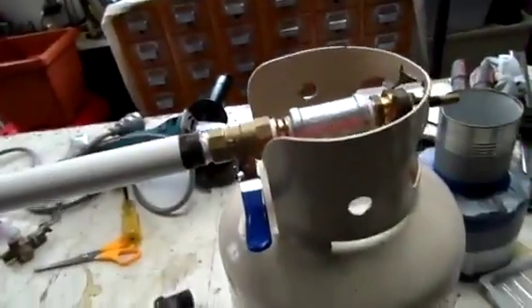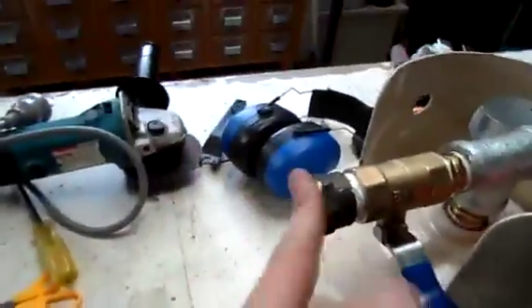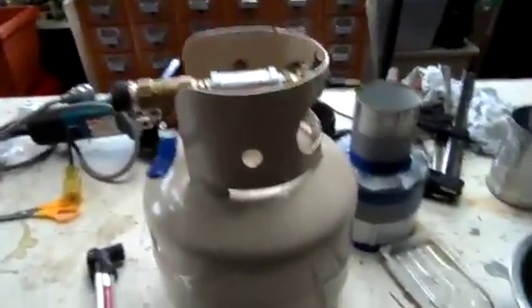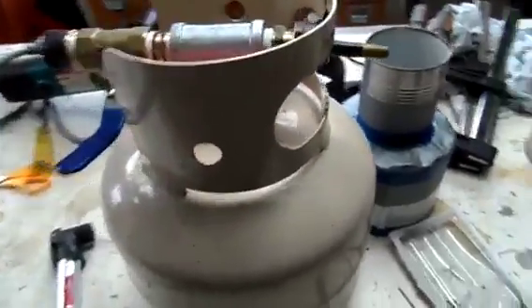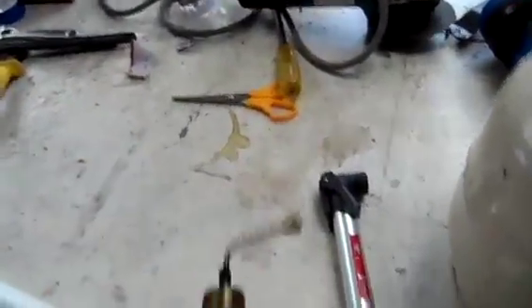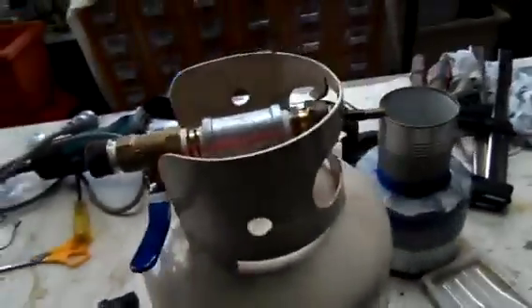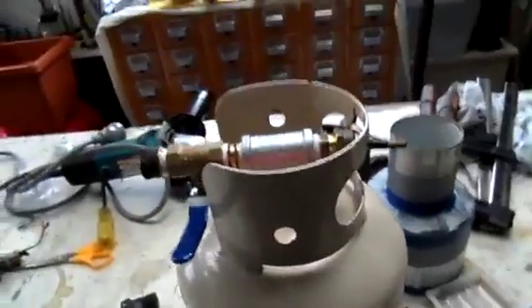Do I really need to say anything about this? I know somebody's going to want me to turn this into a compressed air cannon — as much as I'd love to, I don't know, it might happen. Anyway, that's how you build an air tank out of a gas cylinder. Be safe, don't do anything silly with it — compressed air can be a bit dangerous. Make sure you properly clean your tank out once you've got the valve out. I'll put a couple of videos on how to get these out. I just used a hammer and a mason's chisel and smacked it out, but there are dozens of different ways to do it.